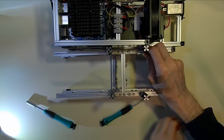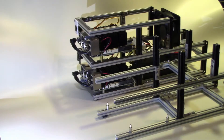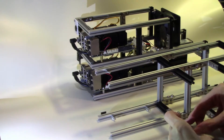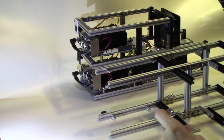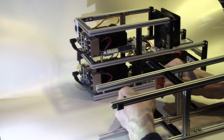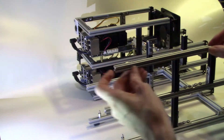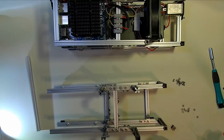Using Maker Beam makes the construction of these prototypes very straightforward — you just need a bit of forethought to work out where everything goes. Now we're just about to put the last units on. This is the final 20cm horizontals. Once these are in place, there's a simple couple of little horizontal 9cm cut struts at the front to put in and then the unit will be complete.